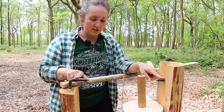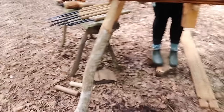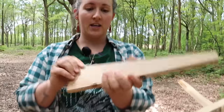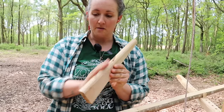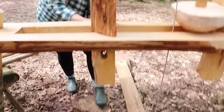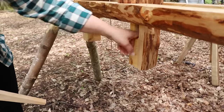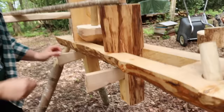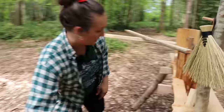So centers, center points, poppets, lathe bed, again, legs, maybe the most obvious. In the poppets, there's two wedges that have been made, and they're slightly rounded on the side. They wear down, like when there's a rounded shape or a chamfer or something, it will last longer. And they fit well because they're also rounded in here, because the drill bit that came in here is also round. So it matches with that, and then wedges in and holds them in place. When we put this poppet in, we anchor it in there so it doesn't move